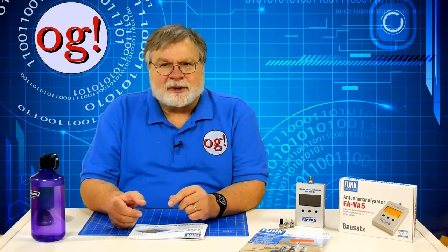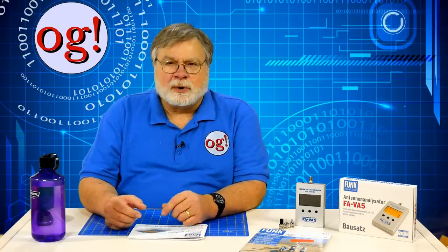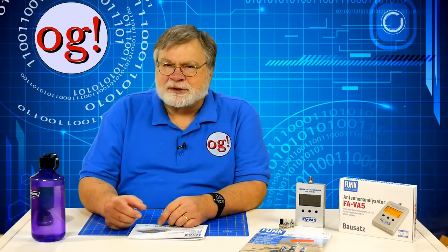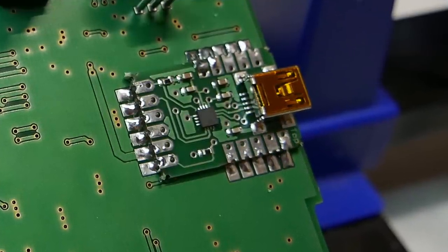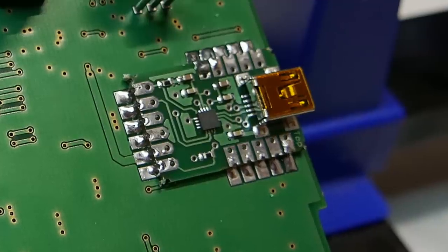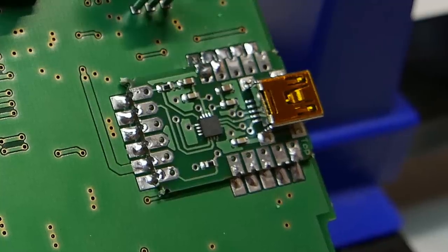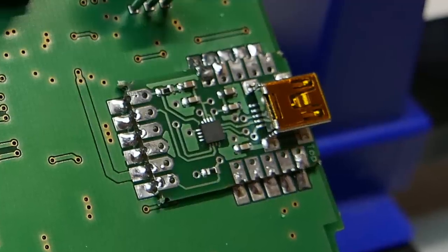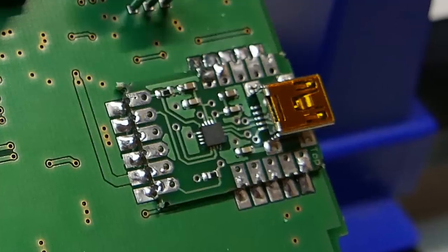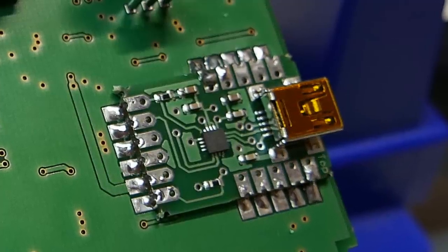After installing the socket pins for the display, you are instructed to remove the display prior to soldering other components — do so very carefully and slowly, as you can damage the display. Putting the USB board on just right was difficult. There's a mica spacer underneath that kept slipping, so I finally used a piece of double-sided tape to hold it in place. The USB daughter board doesn't lock into anything and there are no holes, so I had to set it by sight. Solder just one connection and then adjust until the positioning is perfect.